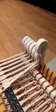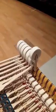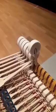No double bounce this time. If I weaken it too much, I have to take the spring out of the slot, grab hold of it at the end, bend it the other direction to add more strength, then put it back and test it again. After a fourth attempt — massaging that spring a little — there we go. That's the sweet spot where it rises but doesn't double bounce.